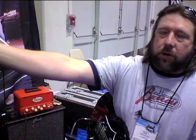And then I would start noticing about half the guys would instantly reverse the gain structure, master down, preamp up, looking for the crunch. Well, the Royal Bluesman has a master on board, but the master only has a single gain stage before it, so there's no way it can cascade. The reason it's there is if you use an external gain pedal, it becomes instrumental in shaping your overall tone. For the guys that wanted to do the heavy metal thing on their own, I needed to do a cascaded front-end amplifier that would allow the rockers to have a grab-and-go amp, and that's what we came up with, the Dirty Red.